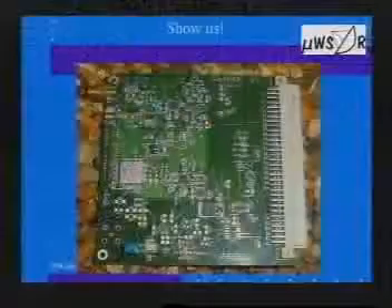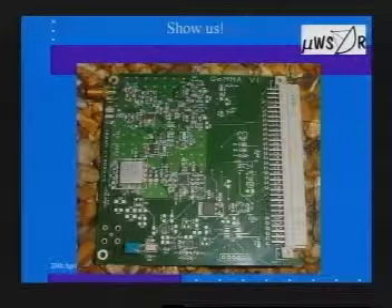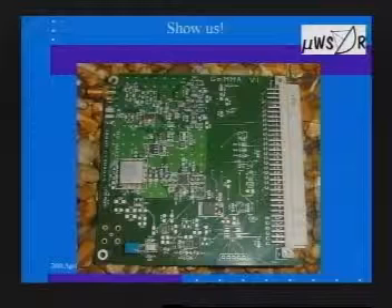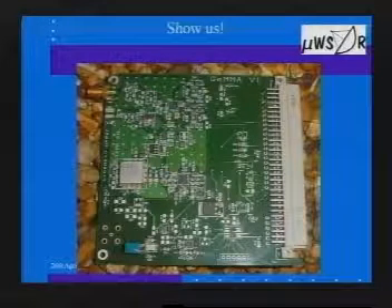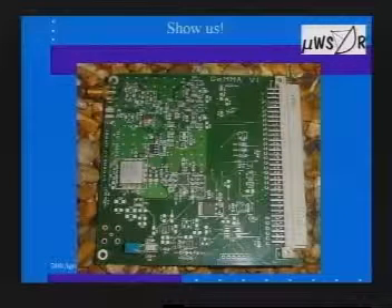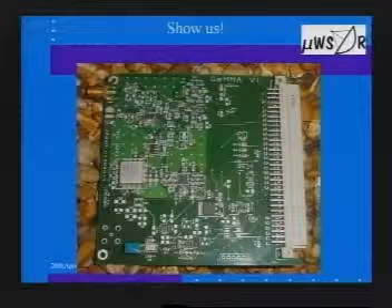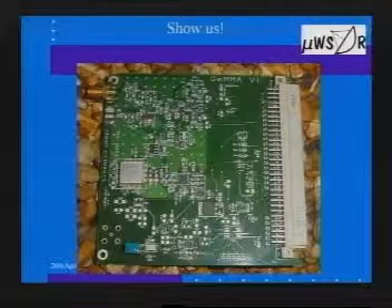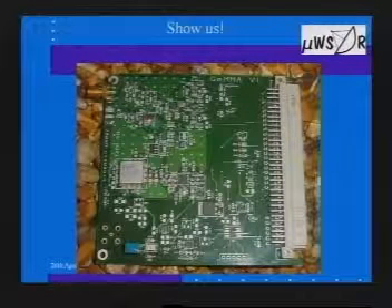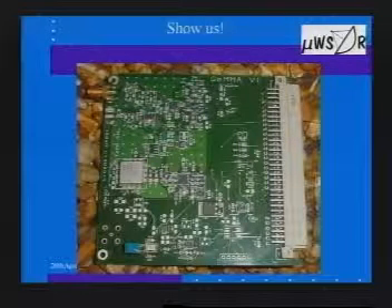Here's the PCB in detail. It's a four-layer printed circuit board. All the components are on side one. Layer two, a short way down, is a solid ground plane. Layer three has some power tracks, and layer four is a second ground plane. We couldn't do it on two layers — I tried and there's just too much circuitry, particularly in the area of the PLL and the IQ modulator. Four-layer boards are fortunately now readily available from a number of suppliers at a reasonable price for a small prototype build.